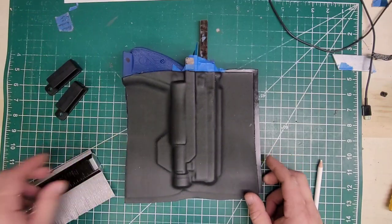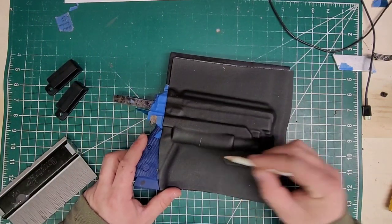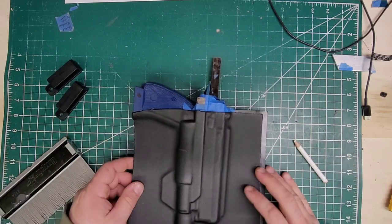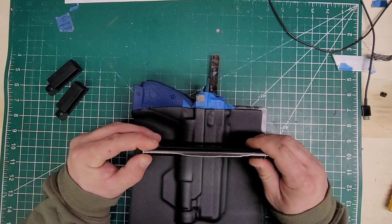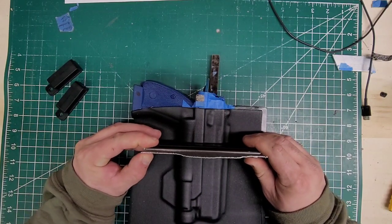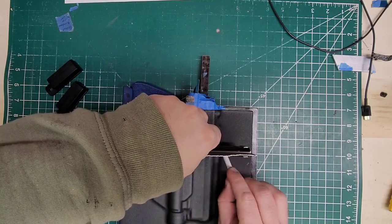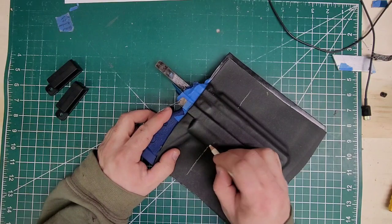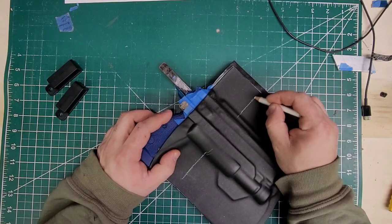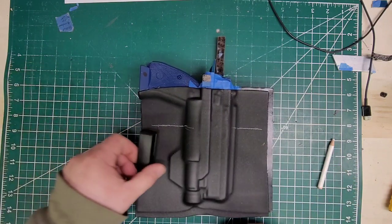And hell yeah. We know the trigger guard generally starts around here, so we want to be able to get a good purchase on here. That's where we're going to start in that area. We're going to use this contour gauge. Get that there, and we'll come up. We're just going to do this right here. We'll draw this part later. Mark where these are going to go.